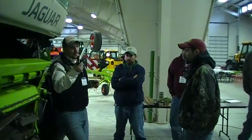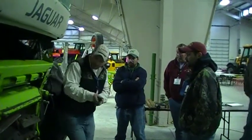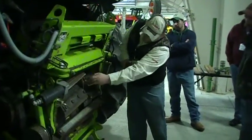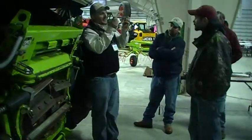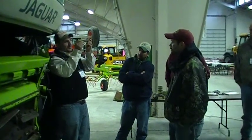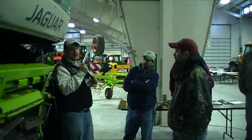So if you happen to come up with an older machine, something to be aware of when you're taking them out is to look at this. Because if you bolt it in backwards, there actually comes up to this weld in there. It'll still bolt in, but it will not be bolted in flat to the bottom. It'll actually be this little edge that's a little bit longer sitting up on that weld. So you actually won't be physically clamping it in there 100% flat.